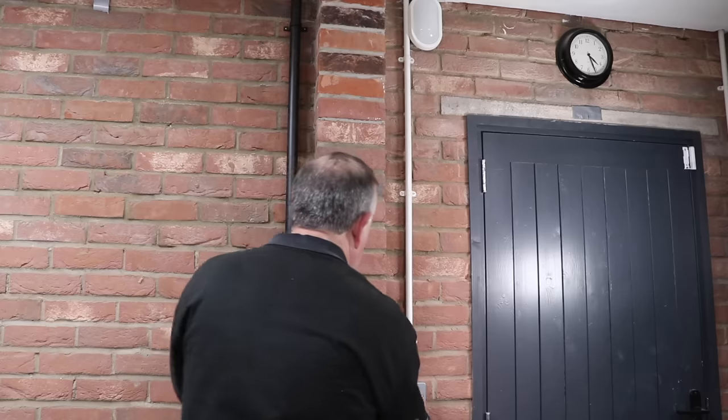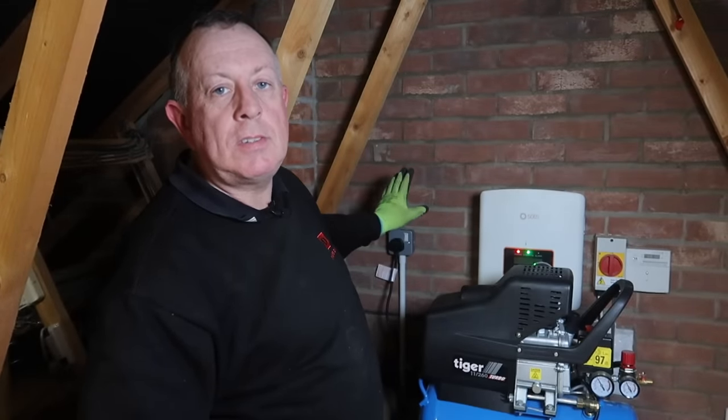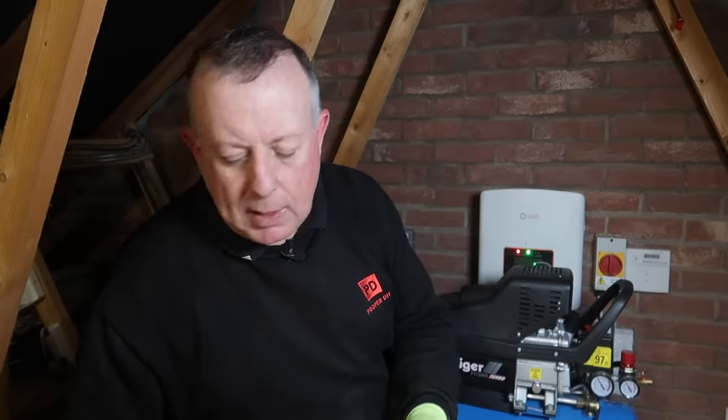Let me quickly explain the electrical side. Everything starts with a standard 13-amp plug in one of my sockets in the workshop. The cable then goes to a fuse switch — the sort of thing you'll find on a fridge or an oven in your kitchen. Then the power comes back up here to a Wago splitter box and splits into two directions: one goes to a light downstairs which tells me whether it's on and will remind me if I've left it on, and the second comes up to a standard 13-amp socket that the compressor is plugged into. So I can control everything from downstairs. There's also a higher risk of fire with a motor up here, so I've mounted a smoke detector — just in case something goes wrong, I should be able to hear it downstairs.